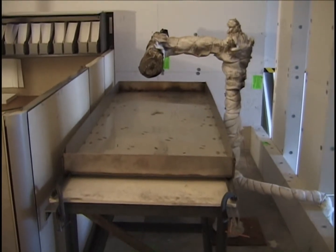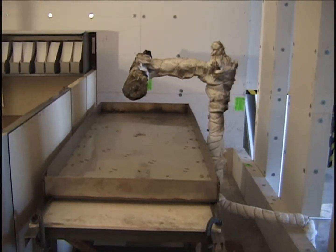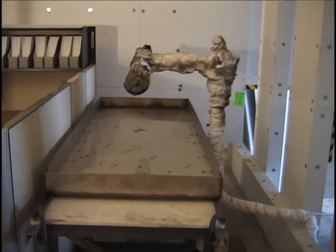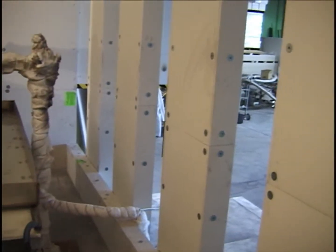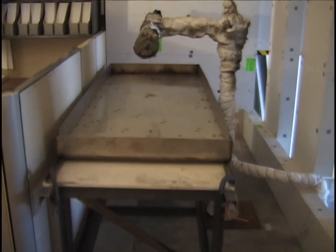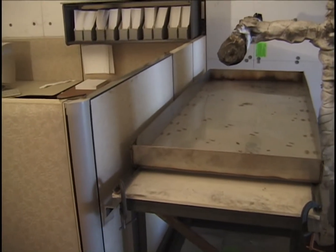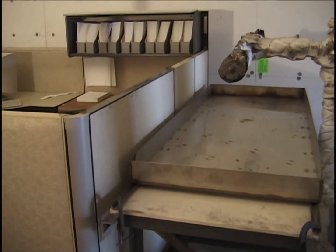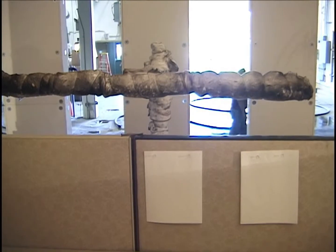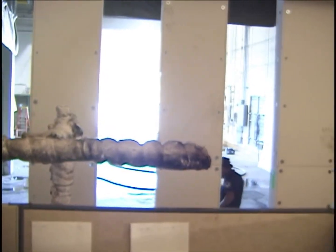This is the layout of the 4 nozzle heptane burner with a 1 meter by 2 meter pan adjacent to cubicle number 1 in the west wall, right next to the openings, simulated windows. It's sitting approximately at the base, 1 foot below the top edge of the west panel of the cubicle. There's another view of that burner. I'm standing in cubicle number 1 now, just pointing to the west through the simulated windows.